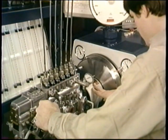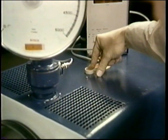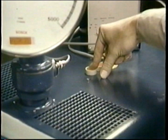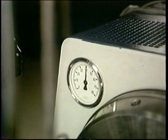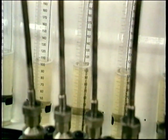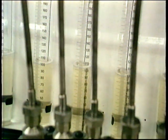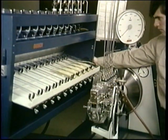Adjust the full load screw to get the specified rack travel at the test RPM — now you've got the specified rack travel. Smart technicians take a draw at this point, but not for the money. Rather, they check out everything: they wet the tubes for a little extra precision, make sure the test fluid is up to temperature, observe the filling, and check the pump and lines for any signs of leaking. Then they dump and drain properly. Now they're ready for an accurate delivery measurement.